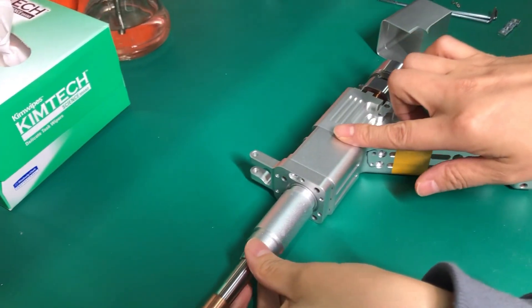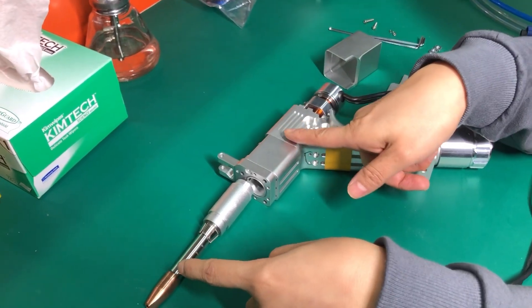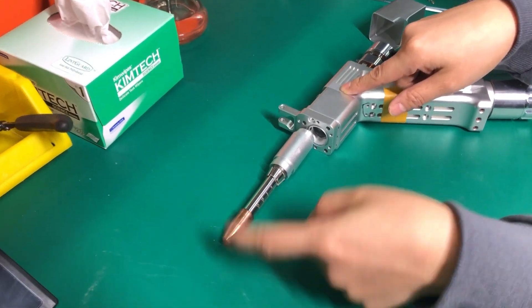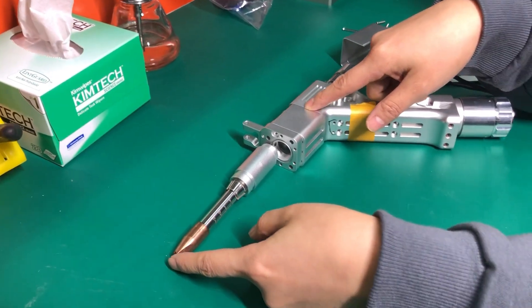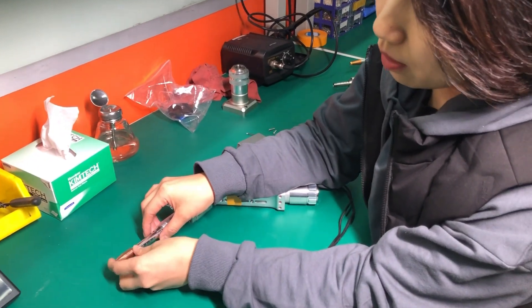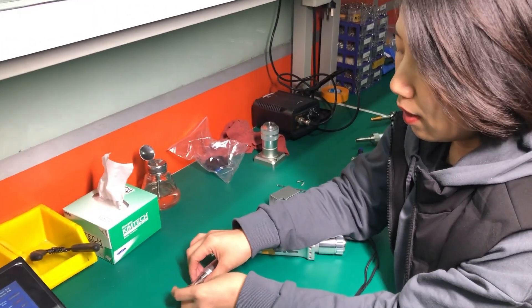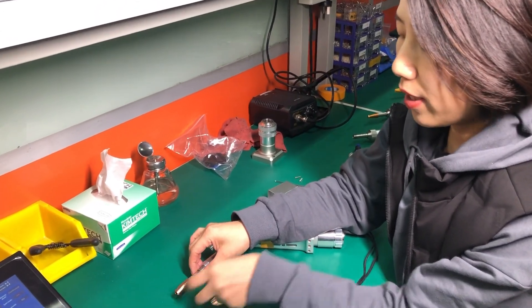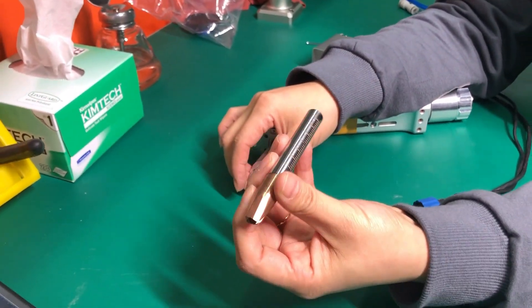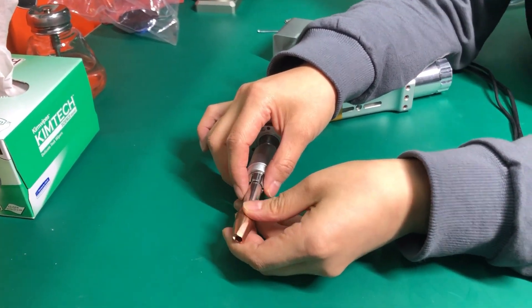If the focal length of the focus lens is 70 millimeters, that means the distance between the lens and the focal point is 70 millimeters — which means the focus is there. You can adjust the focus position for different welding parameters. You adjust here for different focal positions. This tube with the numbers on it is for easily checking the distance of the focus.